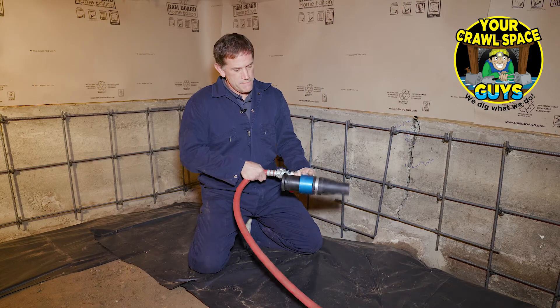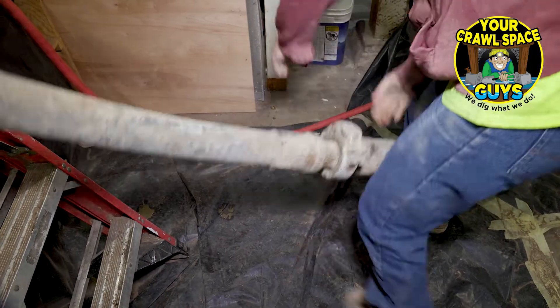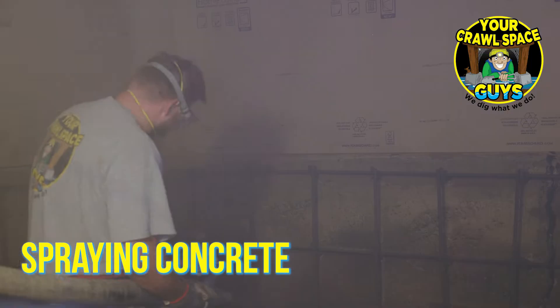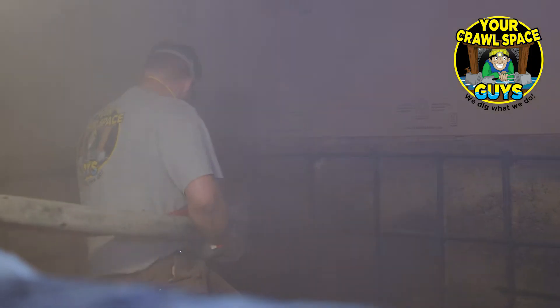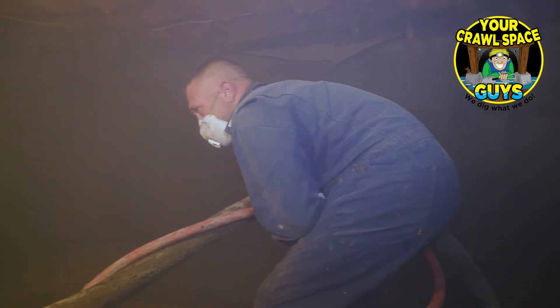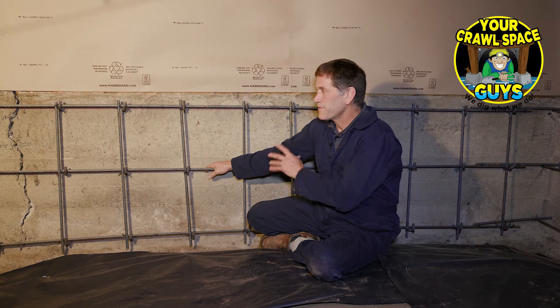This gun with a hose hooks up here and will spray concrete — you add air and spray it on, literally like you're spraying drywall mud. We're gonna build that up about three or four inches thick, and when it dries this will be stronger than it ever has been. I'd also like to say a couple things about a shotcrete concrete repair system like what we're doing.